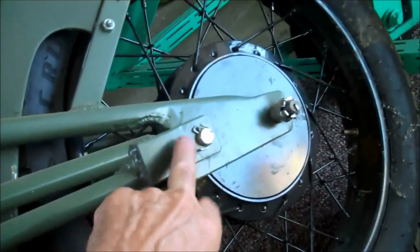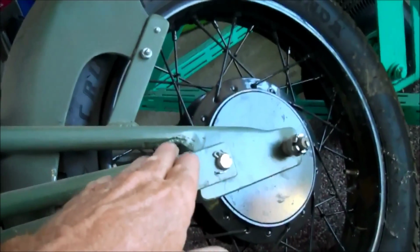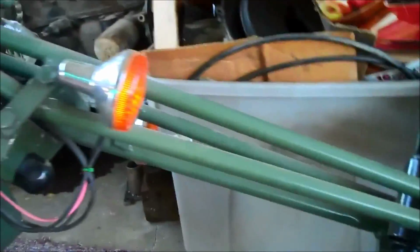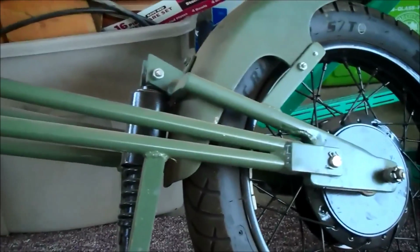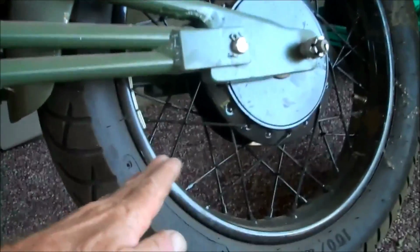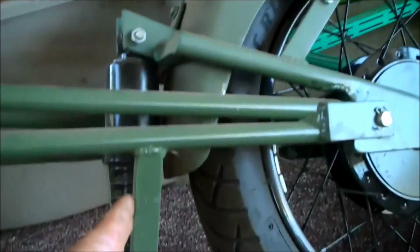a couple of inches for the claw. And that does not include the suspension, because that's not the front end, that's the suspension. They're different parts. They're not one part. So this is a girder, a solid steel girder front end with a leading link single monoshock in the center. The bail is on the top rather than down below, but I put them on the top, which allows me to put the shock right here.